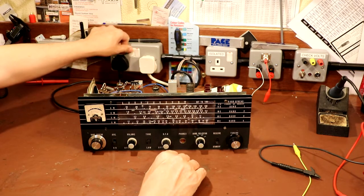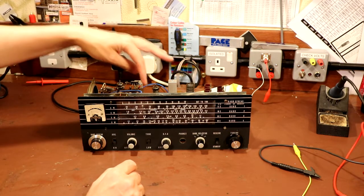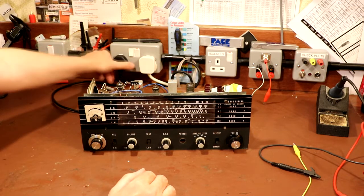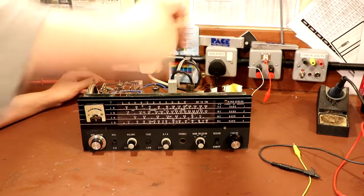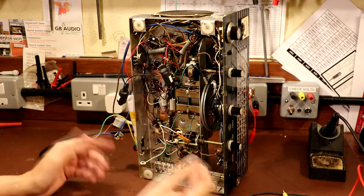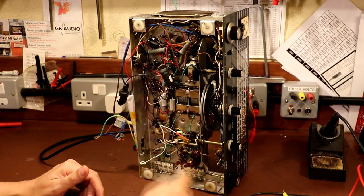Let me just switch this off. I think I really should make some plastic covers for some of these parts - there's an awful lot of live components that I could very easily stick my fingers on, not least the incoming mains here on this blue and brown wire - they're at 230 volts. I'm not plugged in on the isolation transformer - maybe that's a bit silly - so I think we will actually swap that over to the isolation transformer because that's a bit safer. We do have to be very careful working in this radio chassis. It's not a live chassis but it's been considerably hacked at, and like most valve radios the electrical safety is a little bit dubious.